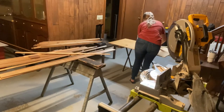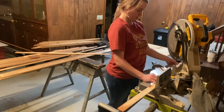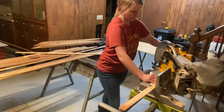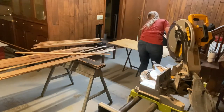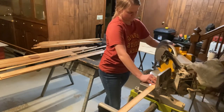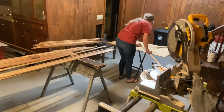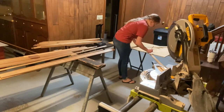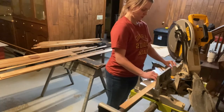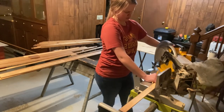Then I went ahead and started making cuts on the wood. I use the same 45 degree angle cut every single time. I line up my garden lath as close as I can to the edge of where the saw is going to cut and make my first cut. Then I bring it over to the board, line up where it's going to go, and draw a pencil line to get another cut out of that piece of wood so it hangs over the edge enough and I get more cuts out of one piece without wasting as much.